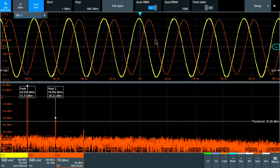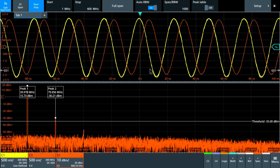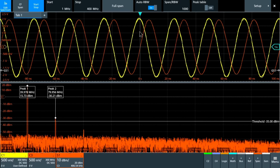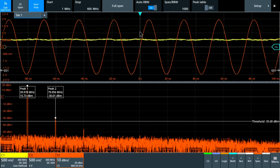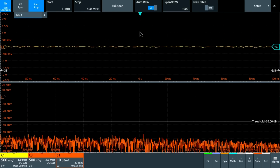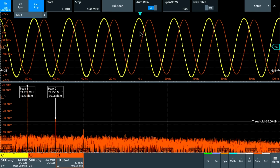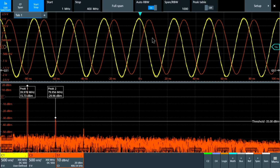We see a nice symmetric signal from the orange line here, which is channel 3, directly from the synthesizer. We do have a little bit of an asymmetry coming from channel 1, which is the probe, and that asymmetry is not from calibration, because if I cal it again and wait for it to finish, it's still there. And if I disable the input, you can see it is flat, does have a DC 0 offset. This is some nonlinear effect that is happening, but we are really pushing the probe again. We're putting a very large signal in at its input.